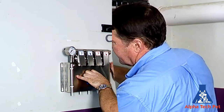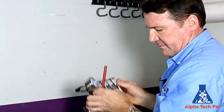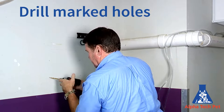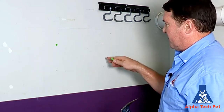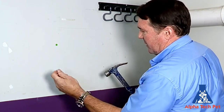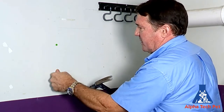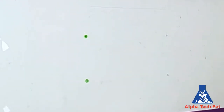So you're just going to mark off here. We hit a stud, so we're going to put screws right into the stud, which is nice. But here we didn't hit a stud, so you can't just put a screw in — the drywall will pull right out. So we're going to put these plastic anchors in first, tap them in, and once you put the screw in it's going to expand and hold it nice and firm so we don't have to worry about it falling off.